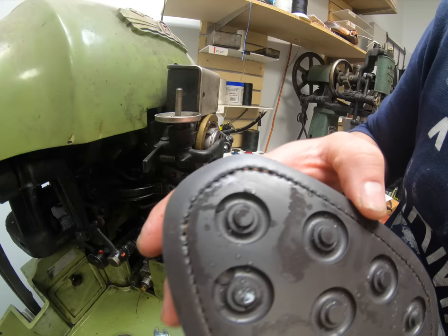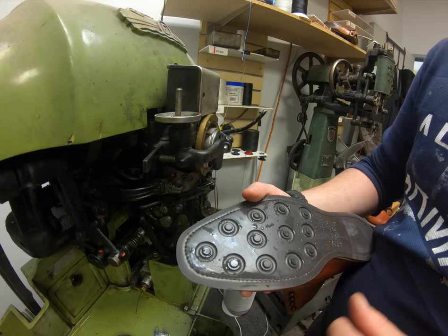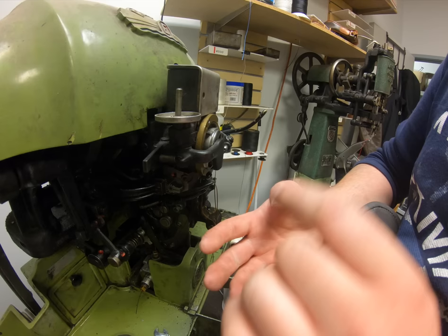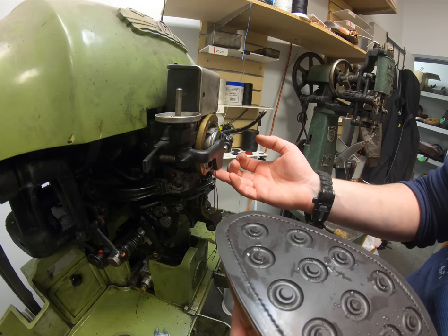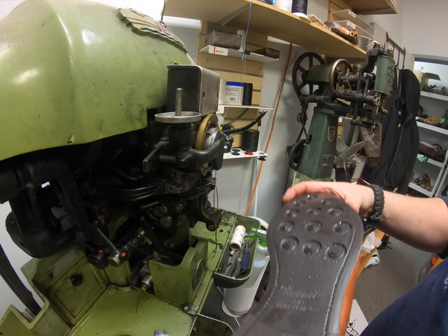There are a few spots where the rubber grabbed hold, so I need to get in there with the awl and just push it through. Rubber likes to stretch, so during certain points of the stitching it grabs hold of the rubber and we've got to realign it with the stitch. It's very hard to do because we're basically lining up three things simultaneously: the blade that cuts the small channel, the awl that comes up from the bottom, and the needle that comes down from the top - all while looping thread around. A lot of shoe and boot brands don't even have the little blade on for their rubber soles because it's harder to do, but we like to have the stitch sitting in the channel as much as possible since it protects it longer.